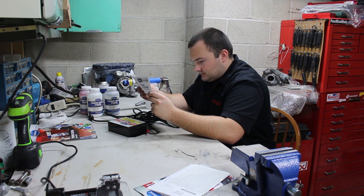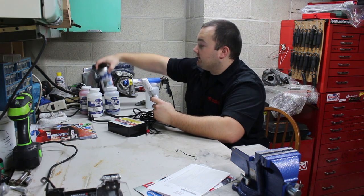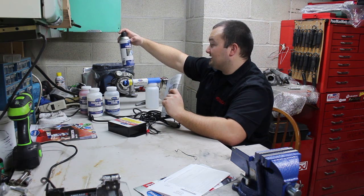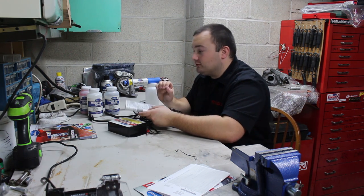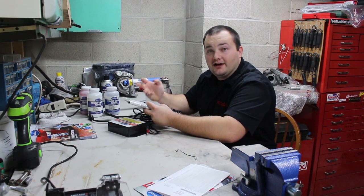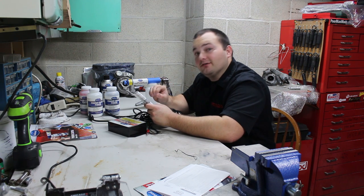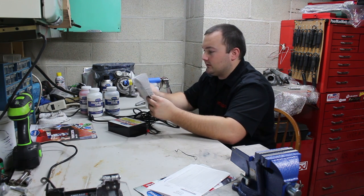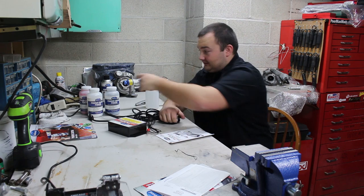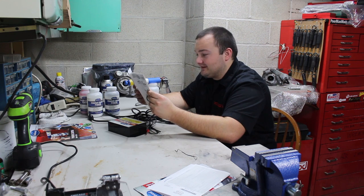The pre-paint prep is probably not included with the base kit either, so you'll have to get it separately. It removes silicone, wax, polish, grease, and dirt. When you powder coat something it has to be super clean so the electricity can properly attract the powder — it's got to be down to bare metal with no rust. Also, the book warns: if you press the trigger and touch the tip, you will get shocked. Don't touch the tip.